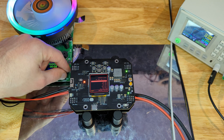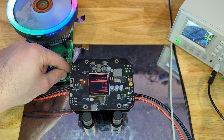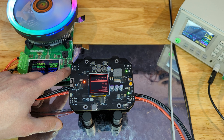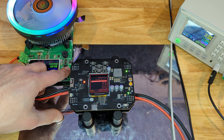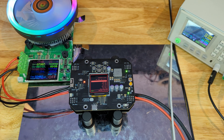The thing is, I knew the motors would draw more power in total than the buck converter can deliver, but I thought that would rarely or never happen. Well, I was wrong. What made the initial converter on my first mainboard work was the ability to turn off this behavior — it would not shut down when too much current was drawn. That's usually not a good idea because it means the inductor oversaturates and ultimately the rail voltage collapses, but that's really not a big deal for my use case. Luckily, this buck converter has the same feature and it instantly made this issue go away.